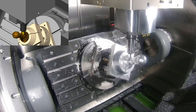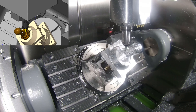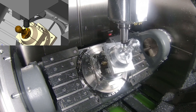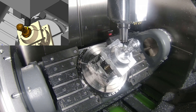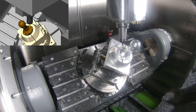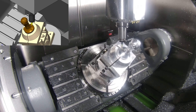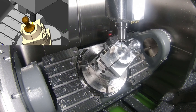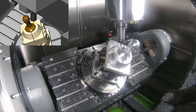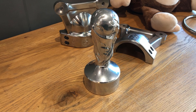As the machining is finishing off, let's recap on what we've done. We've roughed with 3D iMachining on two sides and then used a simultaneous five-axis toolpath to get the finished detail, using Emuge Franken tooling and Sheffield Hallam University's machine tools. If there's anything more you'd like to know about machining inside SOLIDWORKS, please don't hesitate to get in touch — and I hope your team has a great time at the World Cup.